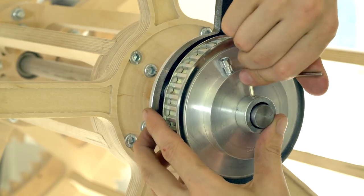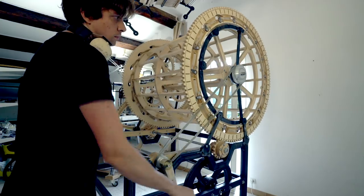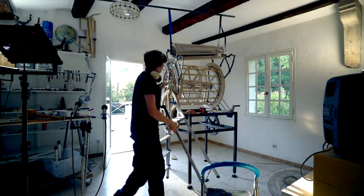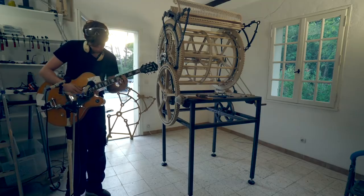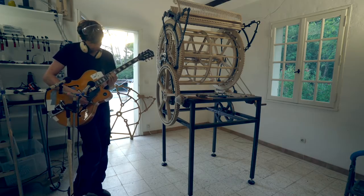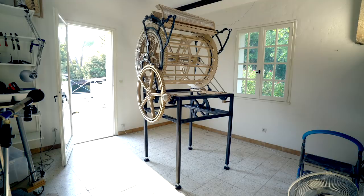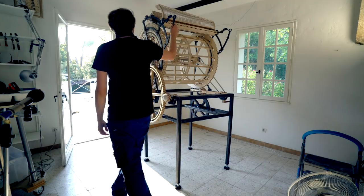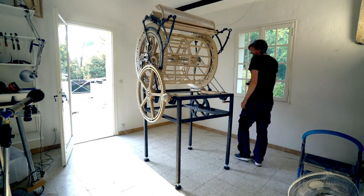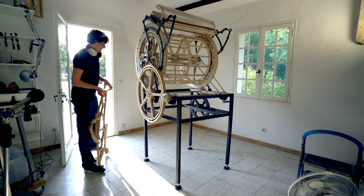This is the big timing belt pulley with 40 teeth, and on it goes a timing belt that goes down and meets a smaller timing belt pulley on the crankshaft with 20 teeth — so we have a 1-to-2 gear reduction on that connection. I could lower the top assembly down onto the programming wheel from the crane, and the crane is really working nicely. That looks incredible — it went from this... to this. That is silly.